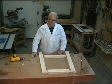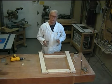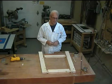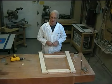The framework for the stand is made from inexpensive framing 2x4s. These have been milled true to 1 1/4 by 2 1/8 and 1 1/4 to 2 7/8. There is no need to be concerned about the 3-degree angles. Dowelmax has been designed to automatically configure to any angle.